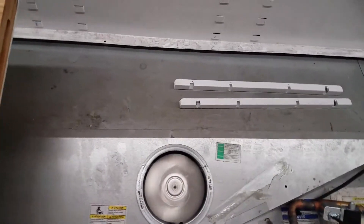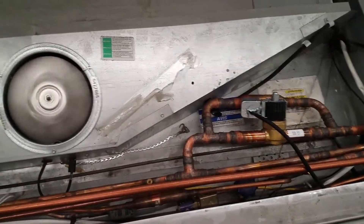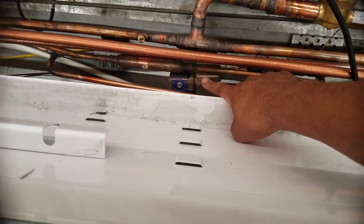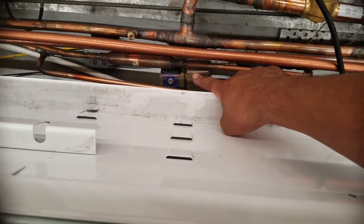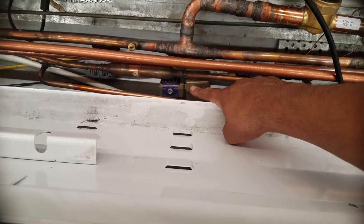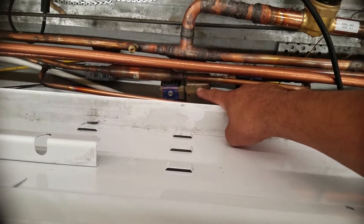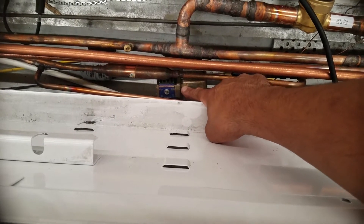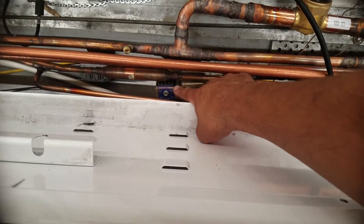I'm over here — came down to the case. This is what I found on my dual temp: 40. I've got a solenoid here that controls my medium temp, runs off of the thermostat. And then the EPR up at the rack — when it's in the low temp, this will stay wide open, and the EPR will control my low temp.